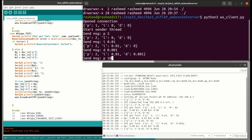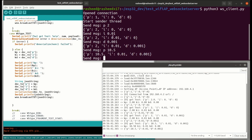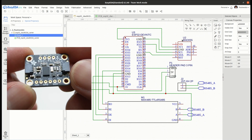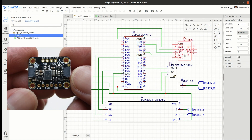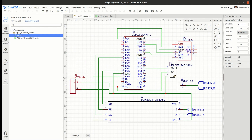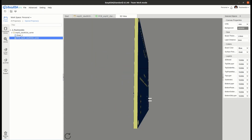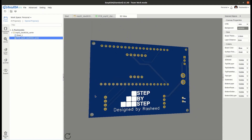Most of the functions seem to work fine, so I think it's time to make a proper design. I started by drawing the schematic for all of my components. The IMU here is the black one I showed you before. I'm going to use XT30 for 5V power input and a JST connector for RS485 A and B. Then we convert that to PCB and start making routes. The 3D view of this looks good, so we can now make a real one.